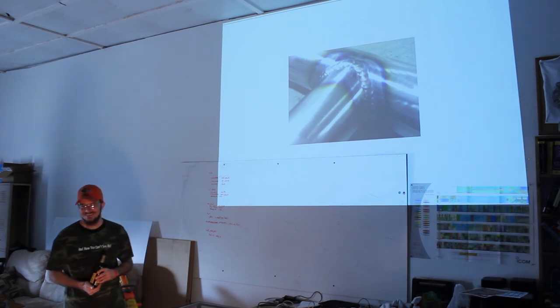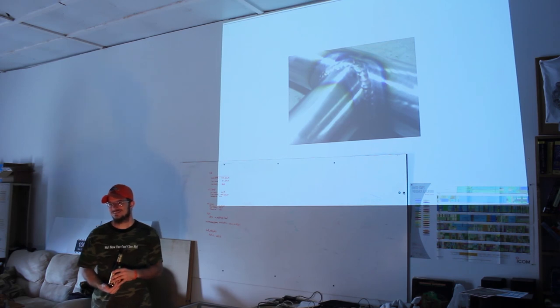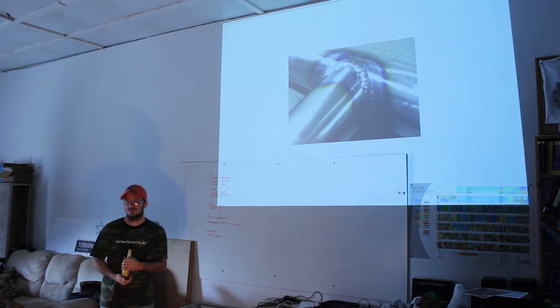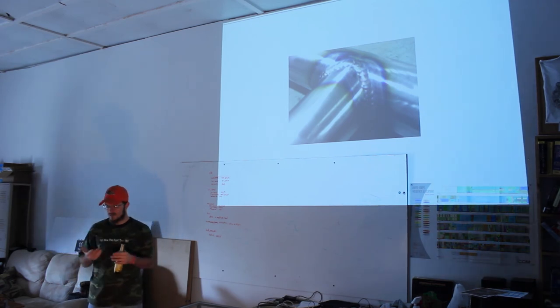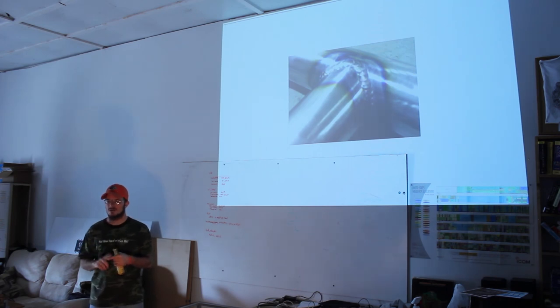One question that I meant to ask earlier. Is there any big difference between cutting and welding, like how you set everything up? Yes, it's a different tip. The welding tip is a real basic deal, there's nothing mechanical to it. You mix a little bit of oxygen and a little bit of acetylene. You adjust it to the right flow, the right sound, the right look, and you're ready to go. With the cutting tip, it's a bit more mechanical in nature because you have the base just like you have with a welding tip.